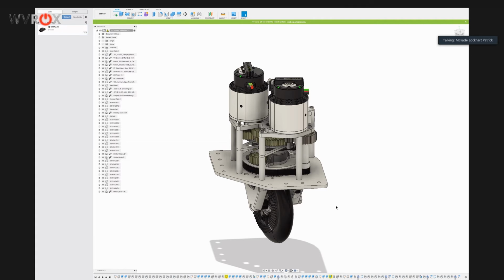As far as the difference in actual robot speed, it's geared so that the free speed is, I think, 9 feet per second low and about 23 high. So in reality, it'll be about 7.5 feet per second low and then around 22 feet per second high. So it's pretty close to a 3x spread.